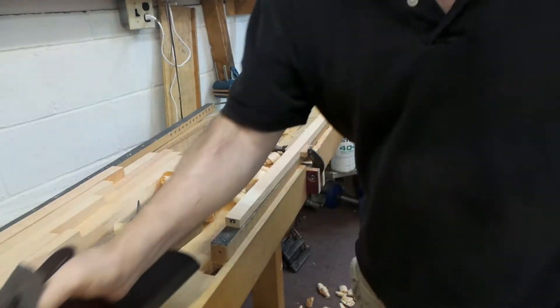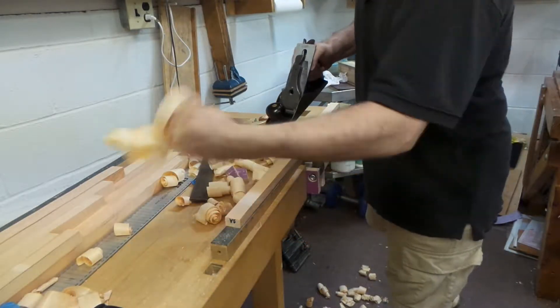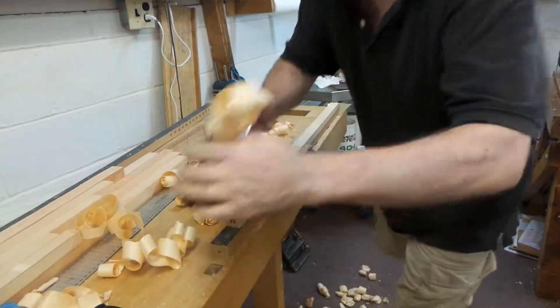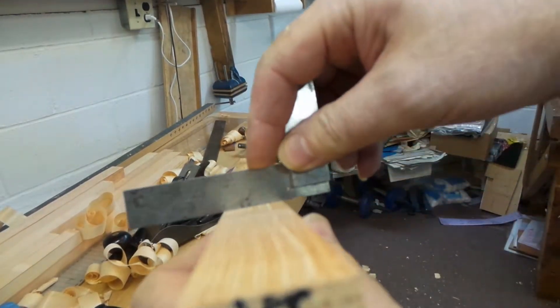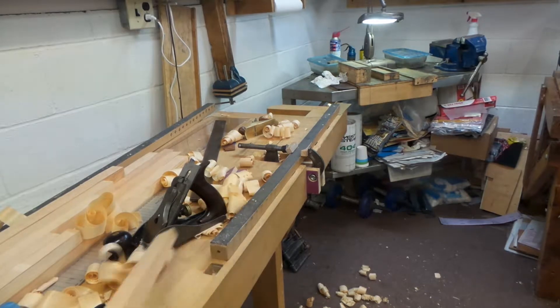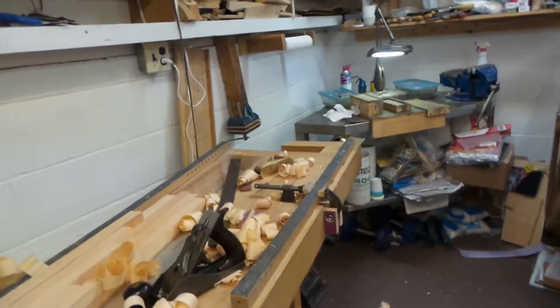There's a pretty good one — I'll take the smoother plane, and I almost made it across, not quite. I can tell by listening and looking at this that this piece of wood is now curved, but it's also straight across here, which is the most important part. Almost to making a soundboard — these things cannot come apart, they can't come off the soundboard or you're screwed. It's not flat, but it's flat across — it's a good glue joint.